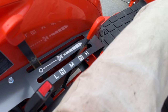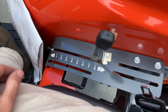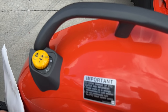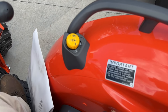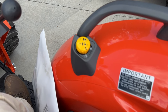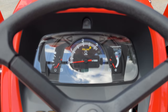Always wear your seatbelt if your roll bar is up. On this other side, you're going to have raising and lowering your three-point hitch. You have all the slots here for adding rear hydraulic remotes if you ever wanted to run hay equipment, an angle blade, or anything else hydraulic off the back of the tractor. You also have a grab handle for safety on hillsides. And this is to engage your PTO. When engaging PTO — your tiller, bush hog, or post hole digger — keep your RPMs low, then engage it, then raise your RPMs. You don't want to have your RPMs on full when engaging.